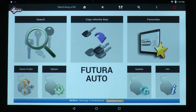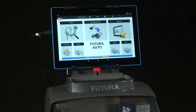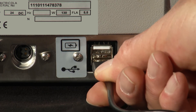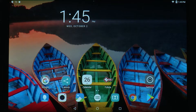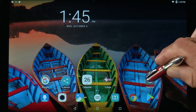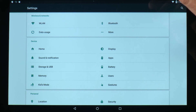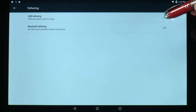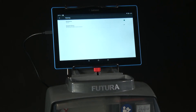As mentioned earlier, the Android tablet may not automatically connect to the Futura, and you may have to force it to connect. You may want to consider tethering the tablet to the machine, thereby eliminating this issue. To tether the tablet to the machine, plug the tablet's power cord into the bottom USB port on the machine. Then go to the settings menu on the tablet. Under Networks and Wireless, select More, then Tethering, and on the right-hand side of the screen switch tethering to on. The Futura will reboot at this point and the program will reload.